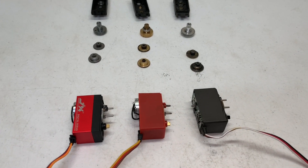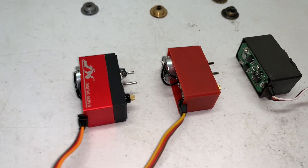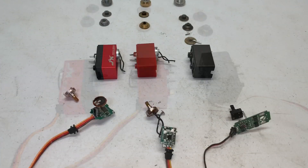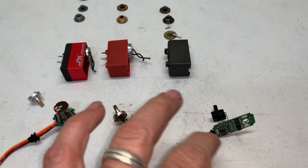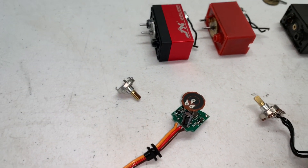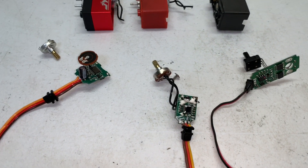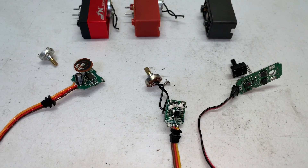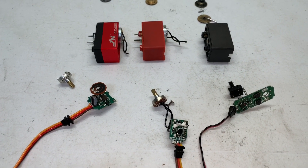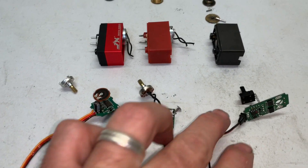Now that we've got the pins out and the gears out for the most part — the first gear is still there — we need to look into each case individually and remove the potentiometer in each one. I've got the boards out. The Traxxas was the most pain because I had to desolder some of the actual motor tabs. This one broke the potentiometer as I was pulling it out of the JX. You can actually use the stock potentiometer and just let the receiver power the winch, however I've had drifting issues with that and you can't really run 3S to it like I can with the Hobbywing 1060 ESCs.